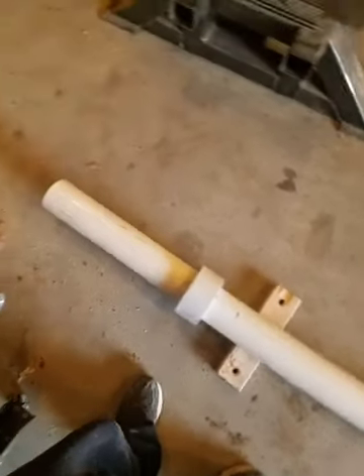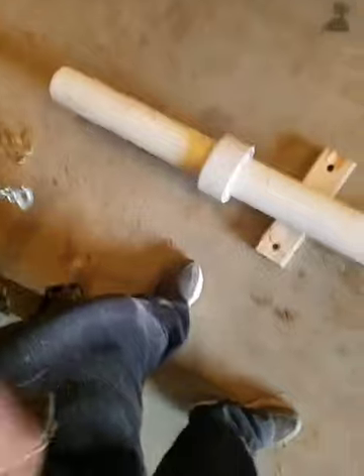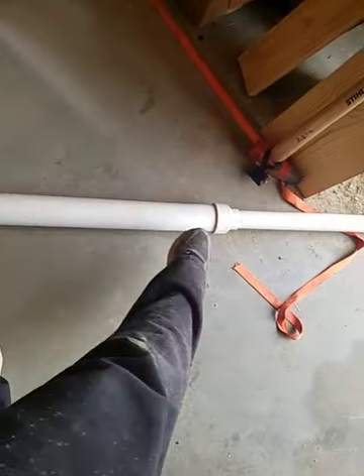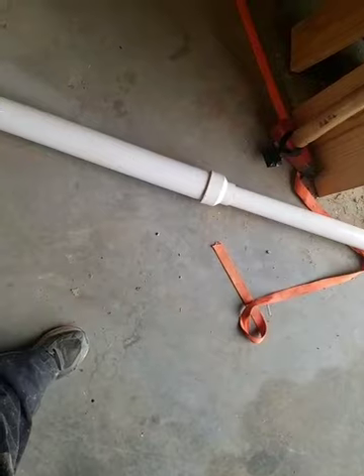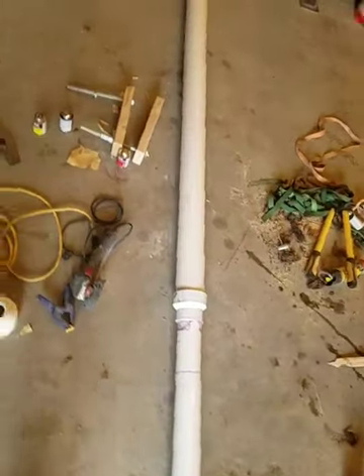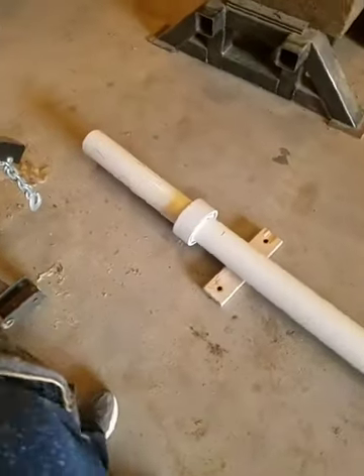Four sections on now. This is the 4 inch pipe — you can see this bushing I've got here. You see how far up the pipe it is. This is the 4 inch to 3 inch joint, and this is the 3 inch to 2 inch joint. Again, these overlap — this reducer is not just connecting these together, the 2 inch pipe comes in to here, the 3 inch pipe to thereabouts — it's a 20 inch overlap. Down here we've got a 24 inch overlap, and so far it seems really solid. I can pick it up, there's not a lot of sag, and the joints definitely don't move.